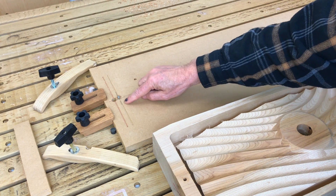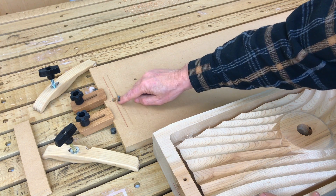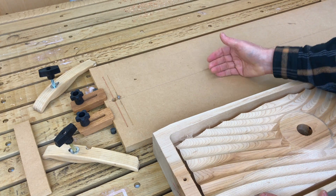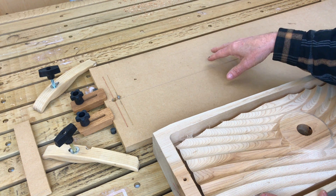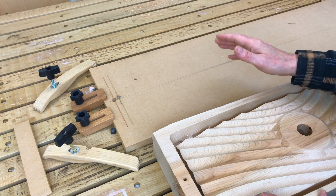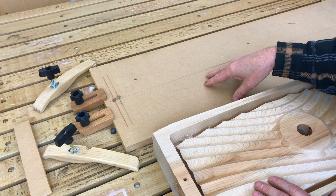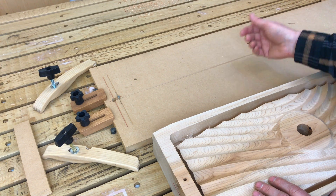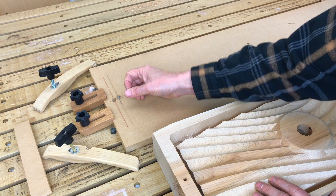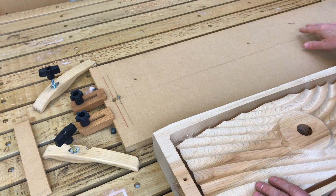There's a line across here — that's my alignment point perpendicular to the center axis. There's a second line here, all outlined in red. I also put in a half inch hole here. The reason for that is from day to day I can check the alignment of this jig. I had to mill up 10 of these vises, which means my machine was turned off and on each day. So armed with a half inch bit, I'm able to lower it down into here, and if it doesn't fit or I need to adjust a thousandth this way or that way, I can. Once that's done, I know I'm registered perfectly to this spoil board.